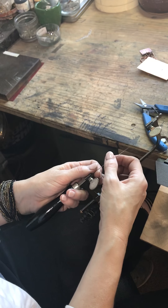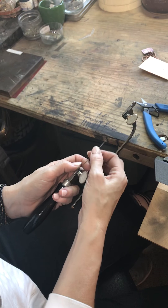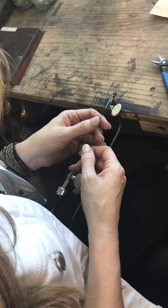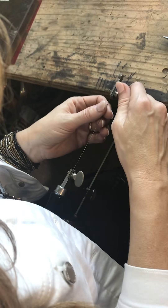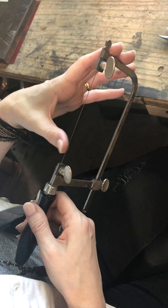Just feel that and make sure it's on the outside. Now I'm going to put the top part of the blade in here, but to get good tension I'm going to put some pressure on my handle, then fit the blade into those two little plates and tighten and let go. When I do that you can see that my blade is nice and tight.